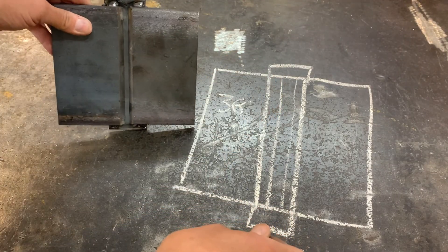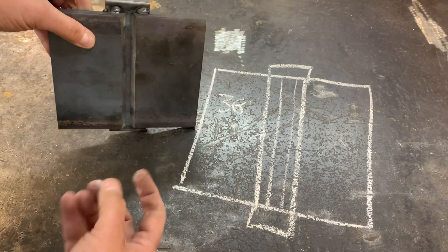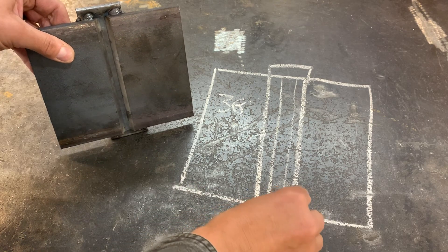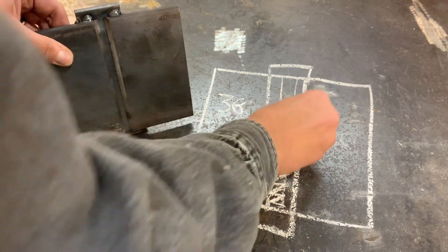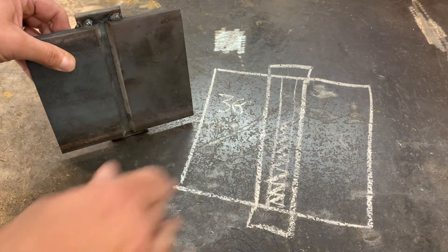This is vertical up, so we're progressing from the bottom up. We want to make sure that we come in at half the included angle for that root pass, holding the wire right in the center and washing into those two bevels nicely the whole way. I like to do a little side-to-side motion the whole way, and the progression is the same as what we did before.